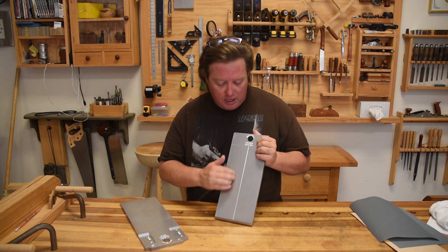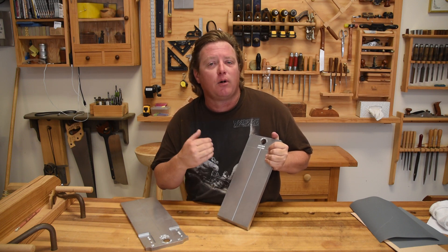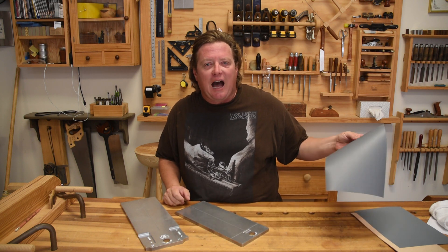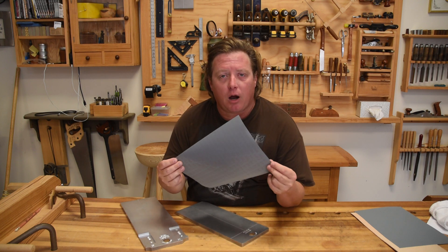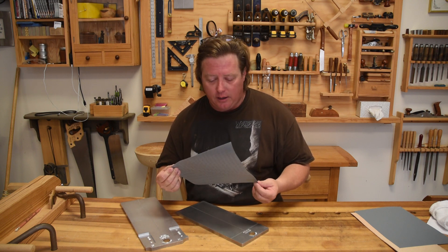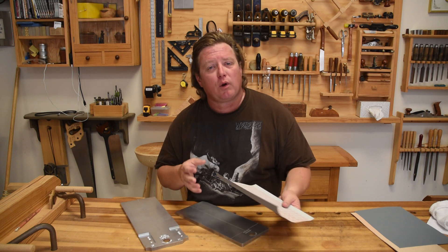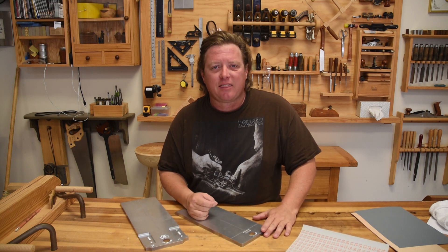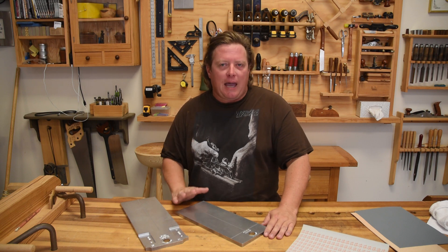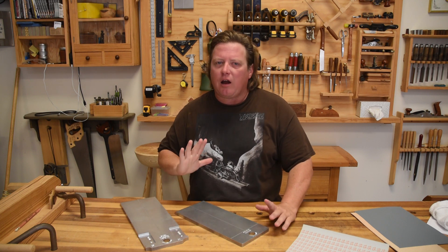Another reason why we use T6, the 6061 variation, is because it is incredibly stable and corrosion resistant, so it's perfect for around the bench. And if you do happen to damage a corner or something like that, you can easily use a mill file to repair it. Both the standard and deluxe versions have a groove running down the center so you can easily apply exactly one-third of a sheet of abrasive to get the most life out of your abrasives. Included in the kit are those abrasives — the two versions I use myself. I really like this 3M product; it's designed for high-speed tool sharpening and works incredibly well. I include a 15-micron sheet, which is the equivalent of about 1,000 grit, which allows me to easily repair a slightly folded edge — something not quite enough for me to go to the stones. I can quickly repair it, hone it, polish it, and get back to work. If I'm doing some chopping and want to add a slight micro-bevel, a few strokes right there and I'm all set.